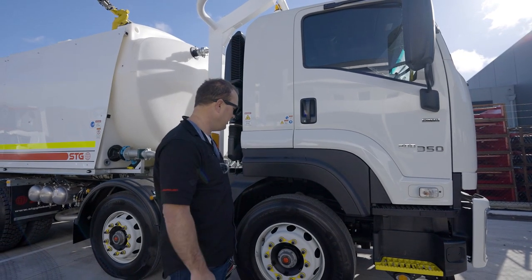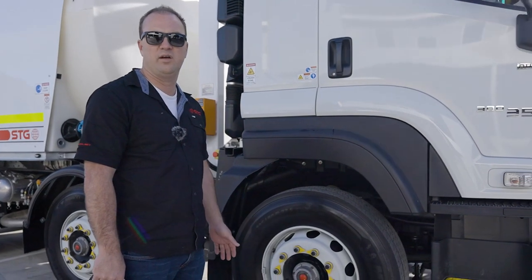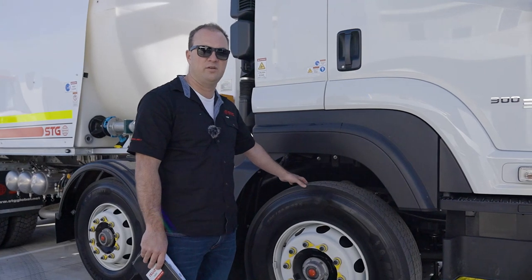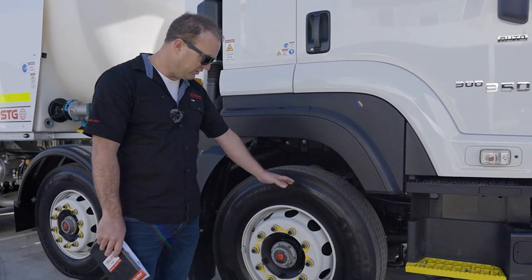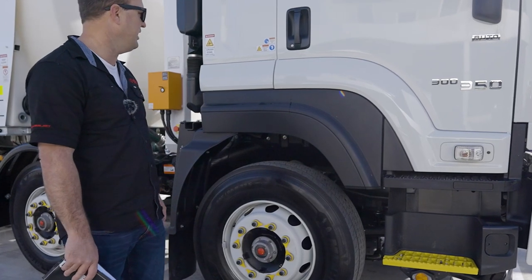When we look at the side of the truck, start with the mirrors, always making sure that they're clean, they've got no cracks so we can visually see what's going on out the back of the truck when we're operating it, and making sure the windows are nice and clean. Tyres are a huge safety issue — water trucks go off-site, across big rocks. They can get slices in the tyres, so we need to make sure our tyres are in really good condition. Always check the tread and check the sidewalls for any slicing from rocks.